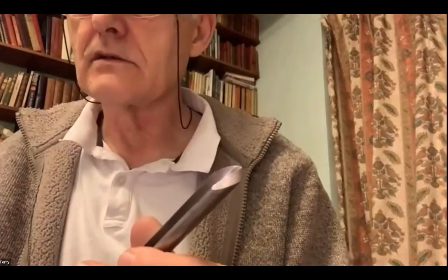But with a bowl gouge, having a swept back edge helps avoid catches. And if swept well back, like the Ellsworth grind, that's what I mean by the Ellsworth grind. It goes by other names as well. Having the long sweep, long wings enables you to use it in different ways. You can use the wings to scrape, half scrape, shear scrape, and you can also make push cuts. So lots of people get on very well with these tools.